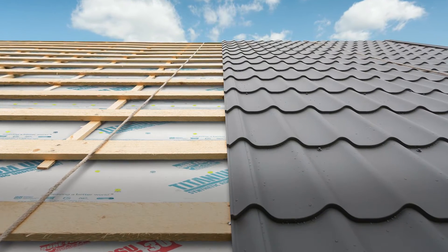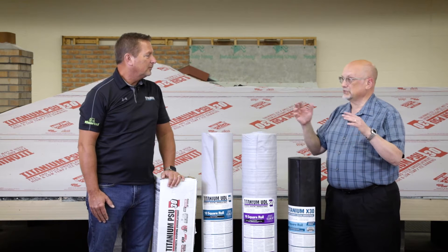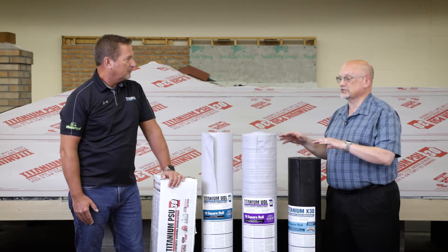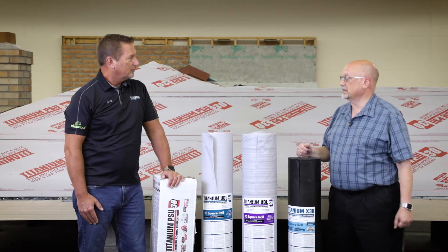So we've got kind of a combination of solid deck, underlayment, and then battens. One of the benefits of that is a lot of times when you're dealing with a smaller structure, being able to have that decking down helps provide some extra protection against condensation on the backside of the metal panels from moisture trying to drive its way out of the structure.